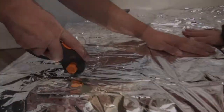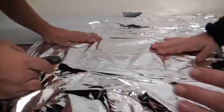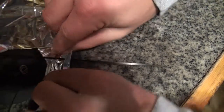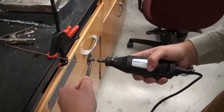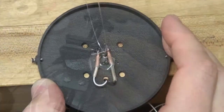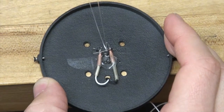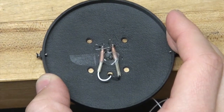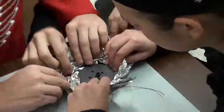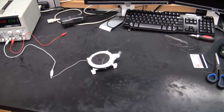First, we attached carbon fiber spars to the central hub and attached the mylar to the spars. We constructed a burn circuit using copper posts, nichrome, and fishing line, and attached it to the retaining ring. We ensured that this circuit could actively deploy our sail by performing a cut test. After this test had passed, we attached the central hub to the retaining ring, wound the spars around the central hub, and secured it into place with fishing line.